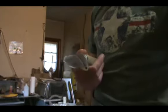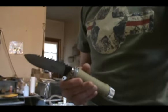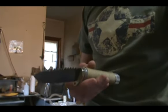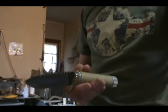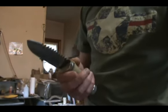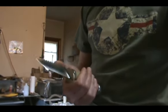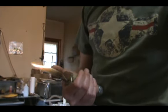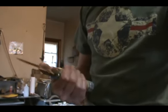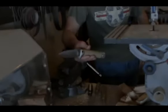Just from that little experiment there — clamping up a piece of wood like that, which I've never tried — it seemed to me that the jet pilot's knife teeth cut better than these teeth. The teeth on that jet pilot's knife are angled for the push cut. I'll have to make a new pilot's knife with a grind like this and do some more testing to see if that'll pan out. If you get the right combination of grind and saw teeth, then they work — the knife just has to be maximized to do it.